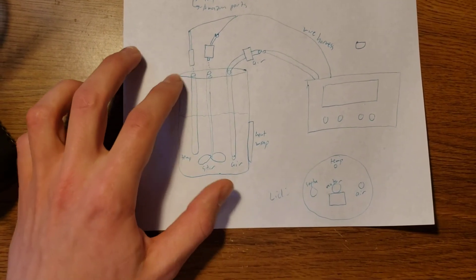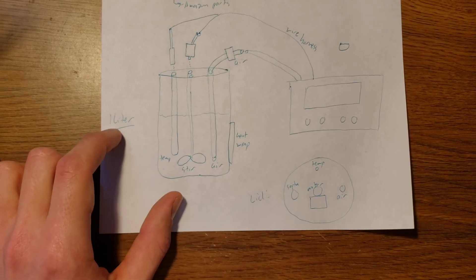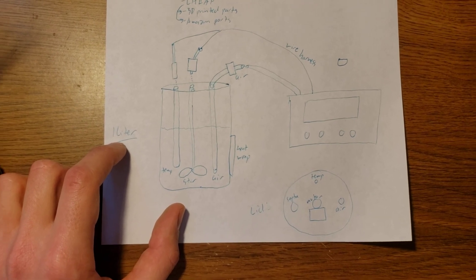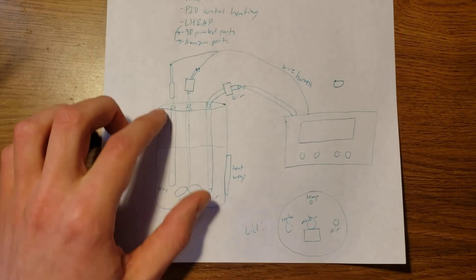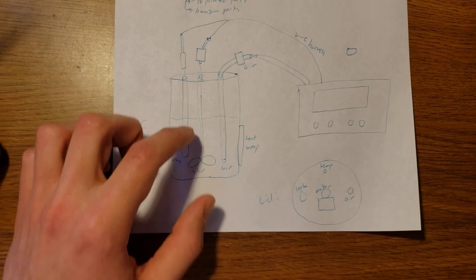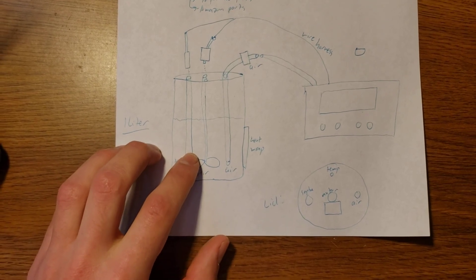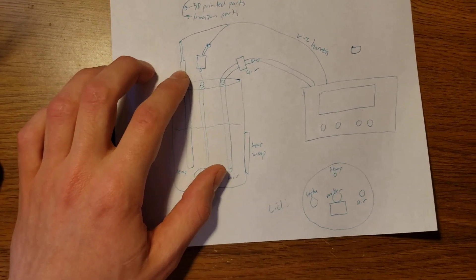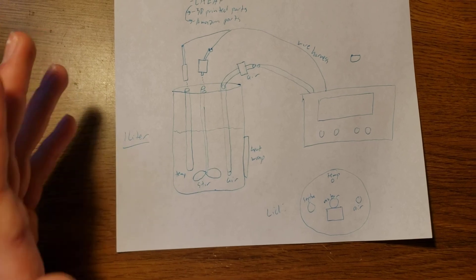So the way that will look — with the temperature probe, what most bioreactors on the market do — by the way, this is going to be a one liter size, and bioreactors that are one liter are usually upwards of $10,000, so I want to aim for this project to be less than $200. With the temperature probe, we want to have a stainless steel tube that's sealed on the end. The stainless steel can be autoclaved, and the outside of this tube will always stay sterile. Since the inside of the tube is never going to be touching the inside of the reactor, we can just drop a temperature probe inside the snug stainless steel tube, and then that's taken care of.